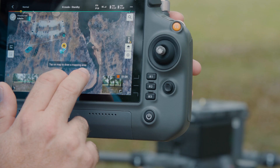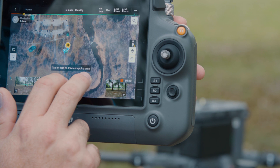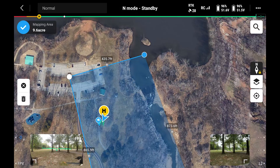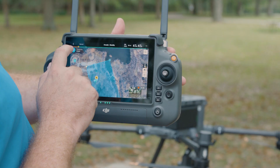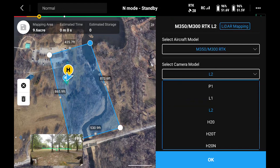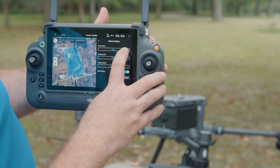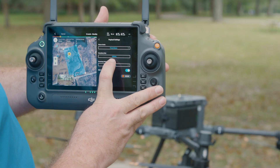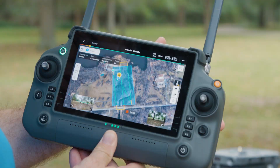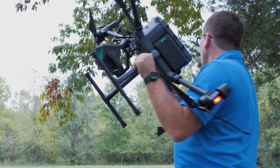There have been some changes in the latest version of Pilot, though it looks pretty similar, which is familiar for users. I'm going to click the points of interest at the boundaries to select my area of interest, then click the blue checkbox. The drone we're using is the M350/M300 RTK. I'm going to go all the way up to five returns — Penta Return — with a sampling rate of 240 kilohertz, and we're going to make sure RGB coloring is on. I'll run through our pre-flight checks and get this thing up in the air to collect the data.